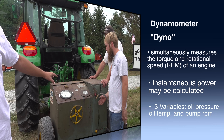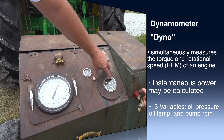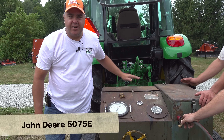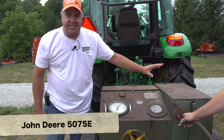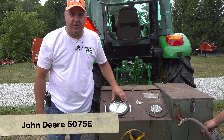It's in the full reading state now. He pulls it down to where it's right on 540. Looks like it might be a little bit high right now. Right now, this tractor is reading about 61 PTO horsepower. The oil is not very hot in here yet, so we're thinking it may change if we let it run for just a little while.